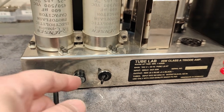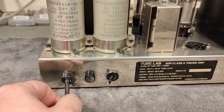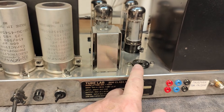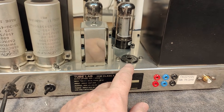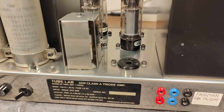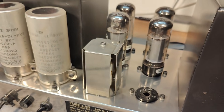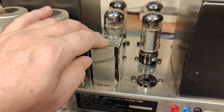There are also some high-current capability capacitors. One thing I'm not super happy about is the on/off labeling. Also, there is a tube missing — a GZ34 — and a relay and charge resistor are in here. In the chrome unit you can see four resistors, which are the four cathode resistors. These are here because they run really warm: the four output tubes run in self-bias mode.